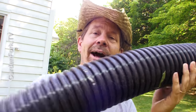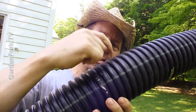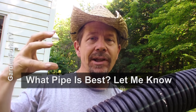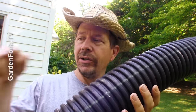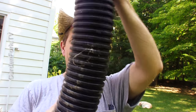There's also corrugated pipe for drainage, and they make a perforated version of this — it has little slits all the way up. But I would rather not use this; I think the rigid pipe is a little stronger. Let me know in the comments below — I'd like to hear your thoughts. But if you have a lot of bends and turns, this stuff bends. It's like a plastic slinky, but it's used all over the place for drainage.